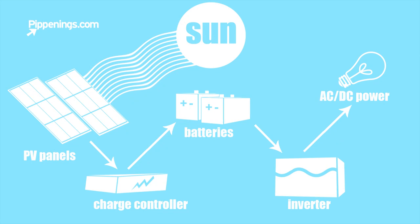You're definitely going to want a charge controller included in your PV setup. A charge controller goes between the solar panels and the batteries. If you just had the panels connected directly to the batteries, during the highest productivity phase of the day — right in the middle when the panels are creating the most electricity — it would just send all that electricity into the batteries and if you got too much, you would burn your batteries out. The charge controller goes in the middle and controls how much charge the batteries get, which protects them.